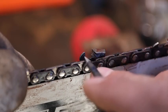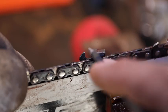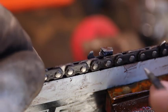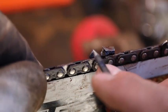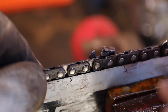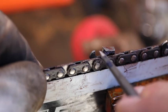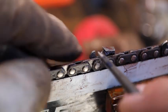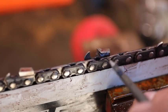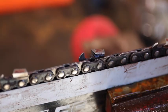What this steel tool is claiming to do is to do these two things simultaneously. If that's possible, I am all about that — I just dread this process. Now I've filed one by hand here just to demonstrate. You can see what it looks like when you take the depth gauge down. I made four strokes on there, and if I feel that, that is cat's claw sticky sharp. You can see there that I have also taken down that raker — it's got that shiny flat spot on it. That's at the proper depth versus this unfiled one here — that comes up to the point, that's the factory edge. Let's see what we can do here.